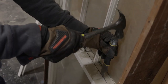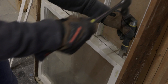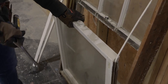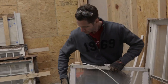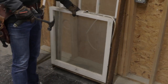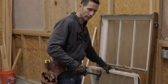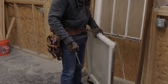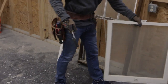As with most windows, that's the problem. Once I get that broken — there's a big paint line on the outside — but I don't have to worry about it because once I pry that meeting rail apart, all that paint line just falls apart and I can pull my sash out. You can see the heavy paint line that was on here. It was able to break apart because I put that five-in-one in here to break the seal, and then you can tilt this back and out. Normally you'd have a stool on the inside, so you tilt it and then lift up about three quarters of an inch to pull it right out. Since the ropes are not attached to any weights anymore, that's how you get your bottom sash out.